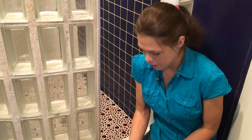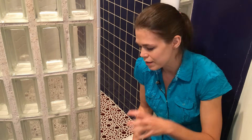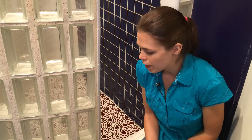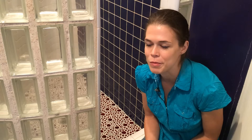Our sealer is on. I had the vent running while I did this because the sealer has a pretty strong smell. I did the floor in two sections because I realized it wasn't a good idea to crawl out onto wet sealer — I didn't want any lint getting stuck in it. It needs to cure for 24 to 72 hours. Because I've been focused on making this floor as durable as possible, I'm going to let it cure the full 72 hours before doing the final caulking around the edges.